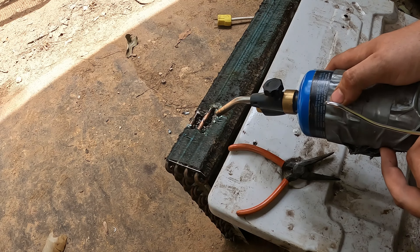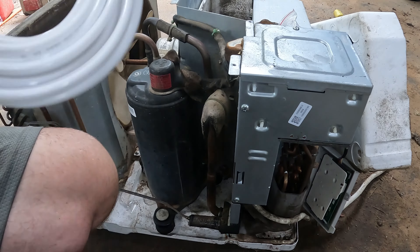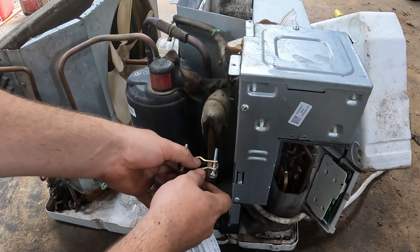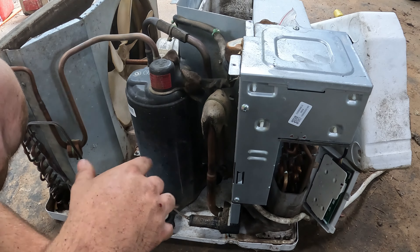So you're probably wondering how I'm gonna get the freon back in the air conditioner because it's sealed. This is a normal old ice maker line and saddle valve — a pierced saddle valve. I'm gonna clamp it around my AC line. The best place on this air conditioner I found is right here on this line. I'm going to bolt it right there to that line so I can clamp it and pierce the hole, because this is on the low side — you don't want to do this on the high side.